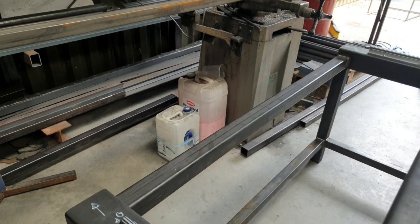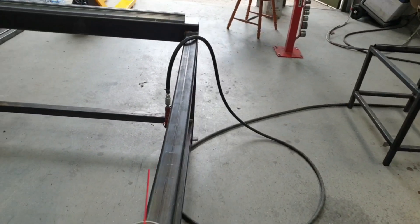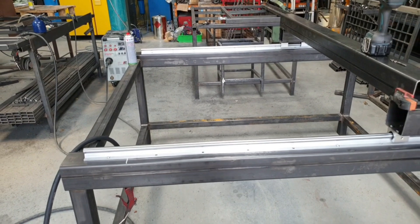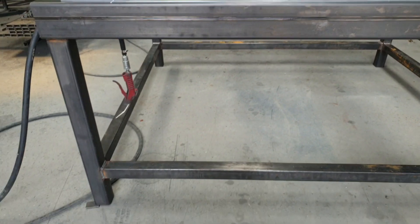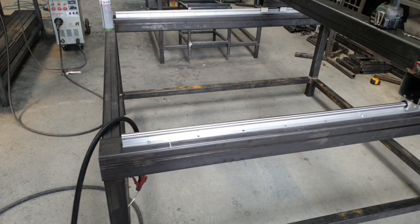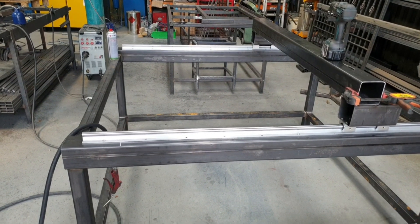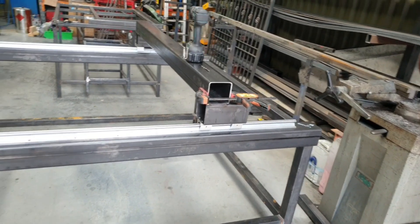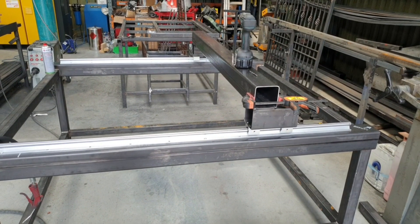I see a lot on YouTube of people just sort of bashing them together, and it seems borderline criminal. You've got to take a little bit of time and make sure that when you set up a ridge initially that it is level — just check across the lines, make sure it's dead level. If not, shim it, because the floor is never 100% level. A standard laser level is only accurate within 2 or 3mm anyway, and a builder's laser level — no point messing around with that, because 2-3mm is a big out.